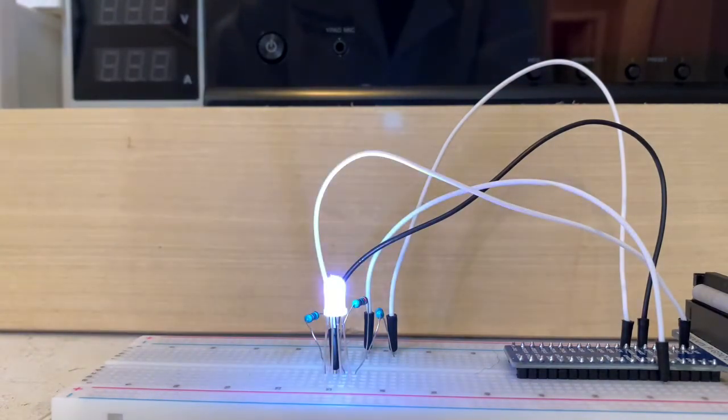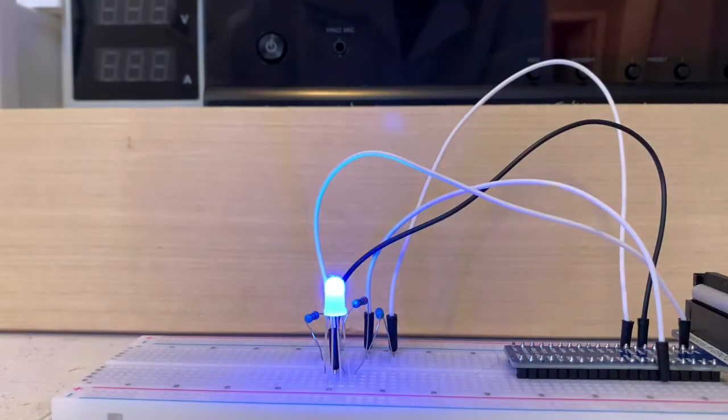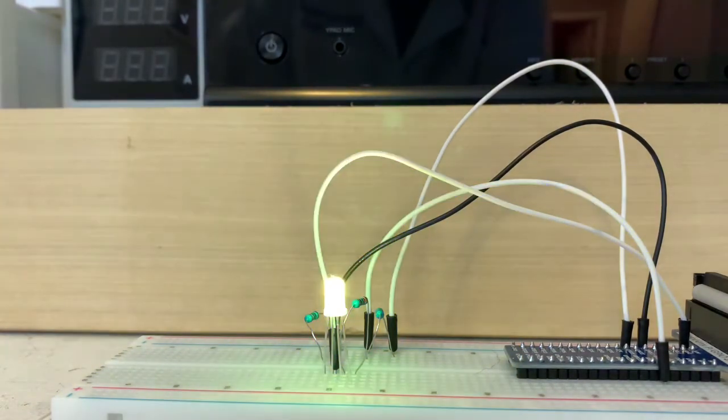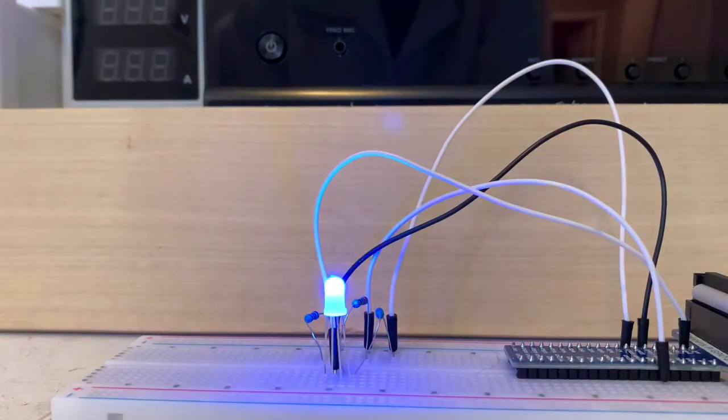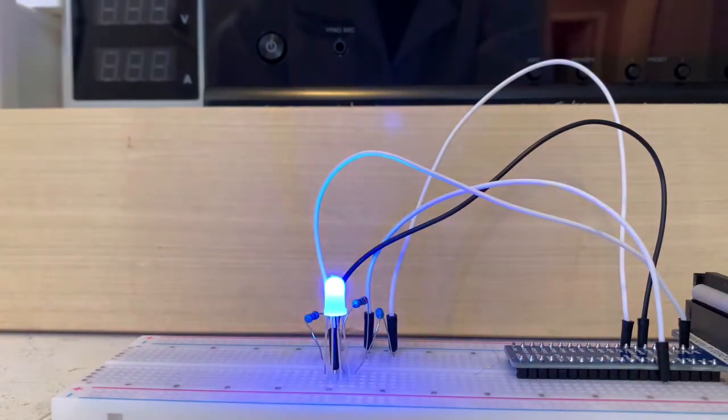Now, as you can see, the colors change every second. Every 1 second we have it as a sleep statement. But we can change that. So we can make it go every half a second, or every 2 seconds, or even every 5 minutes if we wanted to. Or if you wanted to, we could cut the script way in half and we could just make it turn on red or blue or purple or whatever you'd like. So have fun tinkering with this script because this script has a lot of potential.